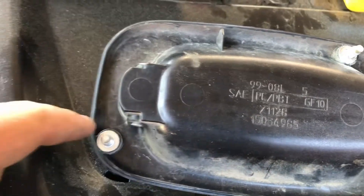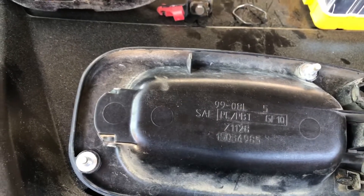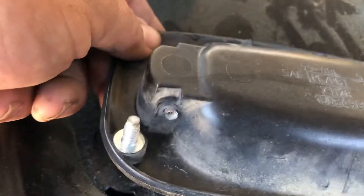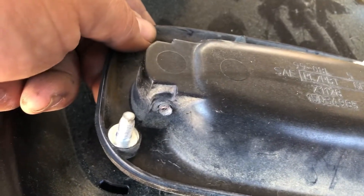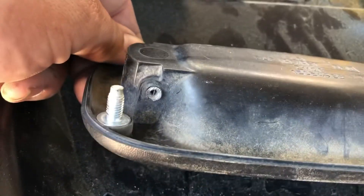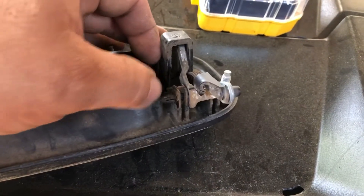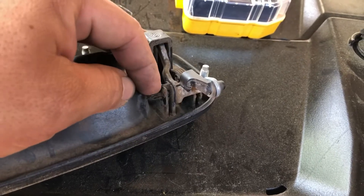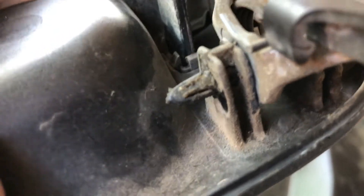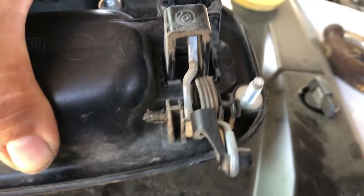Some people like to cut it off with the angle grinder flush, that way you can just pop it out. Some people like to drill it out. And some people like to squish it down with some vice grips or anything of that nature. Once you get rid of that mushroom head you can just pull it out. For me I'm gonna try to drill it out first. Then for this side you got this little pin here — all you're gonna do is just compress these two together and it just comes out this way.